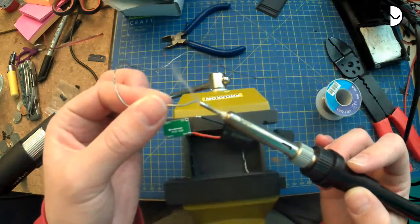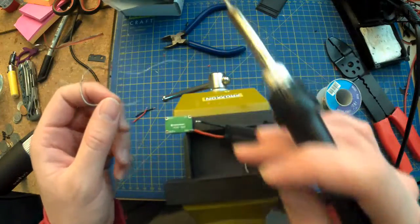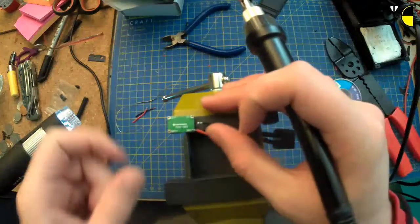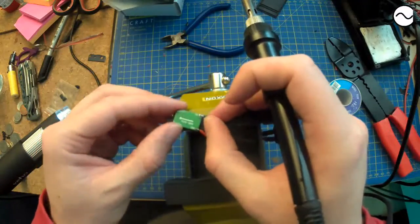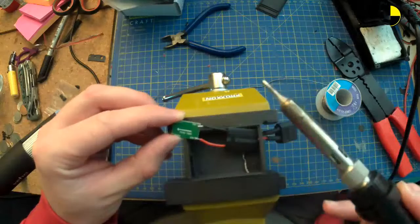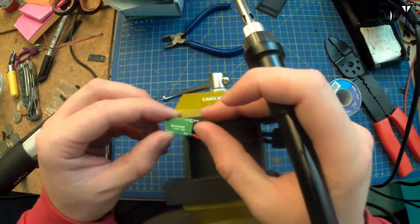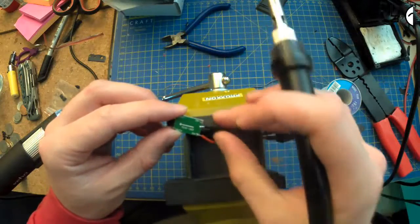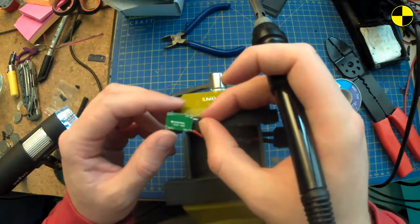So you have all these screws, but that means that it takes a long time to actually put the lid back on because you're faffing about doing this one up by a tiny portion of a turn and then the one diagonally opposite by a tiny portion of a turn to get them all even. And I built this concept and was proving this concept of a vacuum sealed lid mechanism, which would mean that you just suck all the air out and then it holds the lid on, and because you've got a really good gasket there anyway, it should hold it there for a reasonable amount of time.